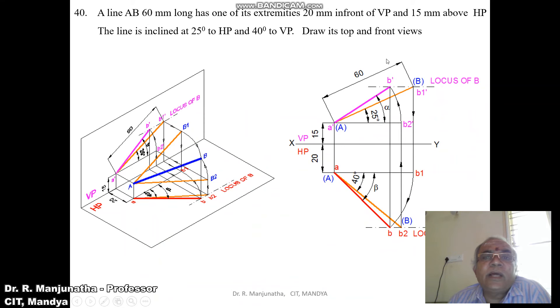When we want to find the true length in HP, the line has to be parallel to HP. When you look from the front view, end point A is 15mm above HP and B2 is also 15mm above HP. The image falls on the vertical plane — A dash is 15mm above HP and B2 dash is also 15mm above HP. So A dash B2 dash is parallel to HP, and since the front view line is parallel, its corresponding top view will be in true length.